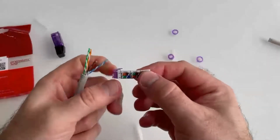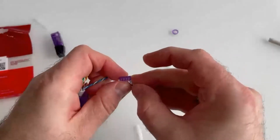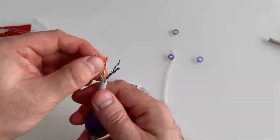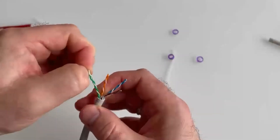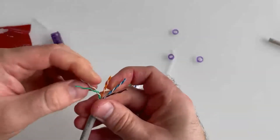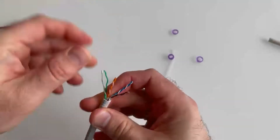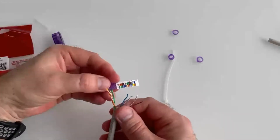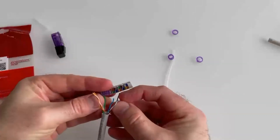Next, we look at the color coding label we have. The label is attached to the wiring cap, so we need to prepare our twisted pairs accordingly. Untwist and straighten them — this operation must be done with each twisted pair. Then we make the installation in accordance with the color coding label of our wiring cap. In this case, we chose the installation according to the standard T568B.